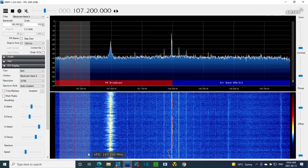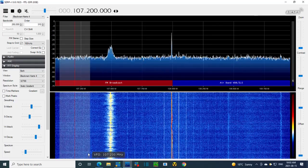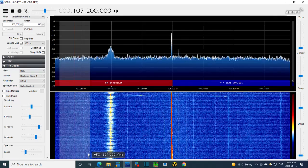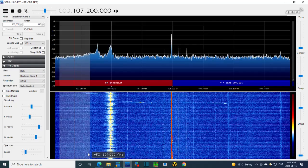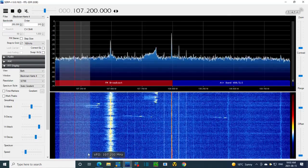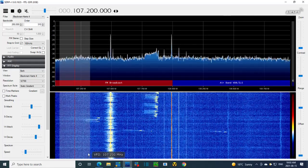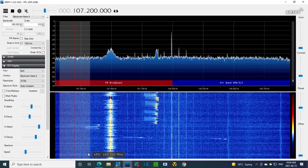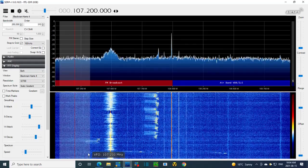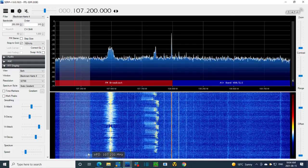Now we'll bring in the second signal, which is the sweep signal. Try anyway. So I'm moving there. It went right by. So this is freakishly difficult to tune with any kind of precision. So you see the sweep just to the left of the marker generator. Let me turn up the sweep width and we'll see what happens. First, let me turn up the output here. Did it get stronger? Change frequency a little bit.